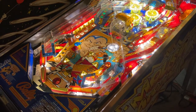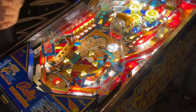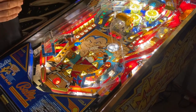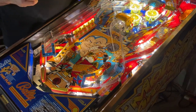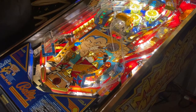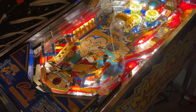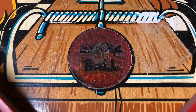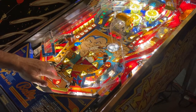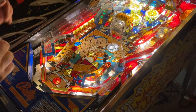Most of the lights are warm white. For the inserts, I typically color match them to give a more brilliant look — except for yellow inserts, where I'll put a warm white behind it. For the blues up toward the top I used an ice blue — it just had a nice look with the insert. Speaking of inserts, a number of them had some pretty big issues. The extra ball insert down at the bottom was actually cracked, almost a hole worn in the middle, and the 'extra ball' wording was mostly gone.